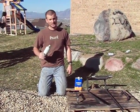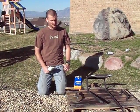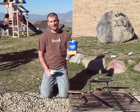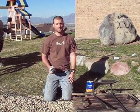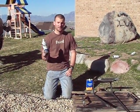Hey everybody, we've got the racks finished up. We've got everything grinded down nice and smooth, all the welds. We've got everything filled in really good. Then what we did is we rubbed everything down with some acetone to kind of clean everything up really nice so there's not any gritty stuff left over from the welds. Now that it's clean, we're going to start the priming.